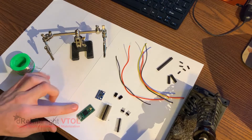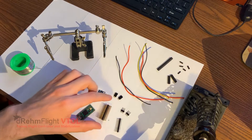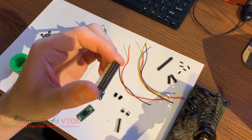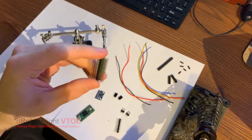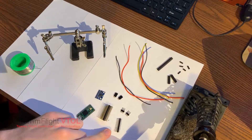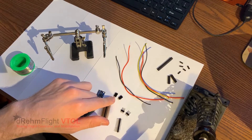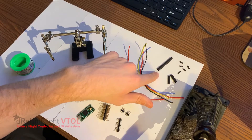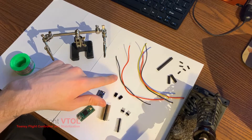For this assembly, you'll need the Teensy 4.0, and I'll be using the GY521 breakout of the MPU6050 IMU. We'll also need 13-pin length 3-pin angled male headers, 11-pin length single male headers, two 3-pin length male headers, and two 2-pin length female headers. You'll also need some shrink tubing, four wires of the same length for the IMU, and some extra wire.